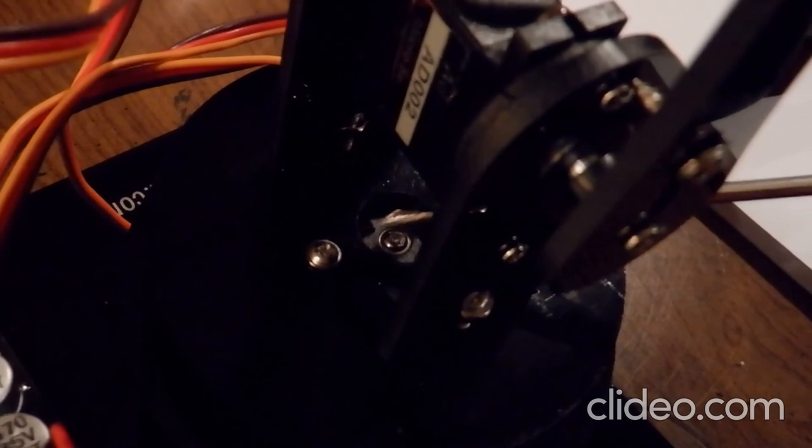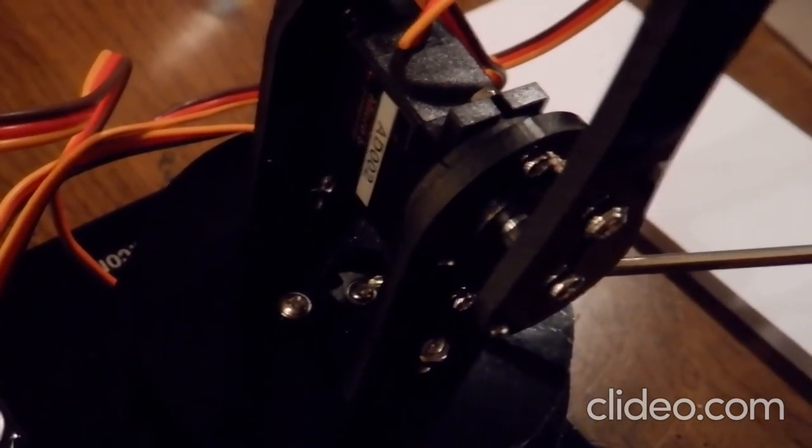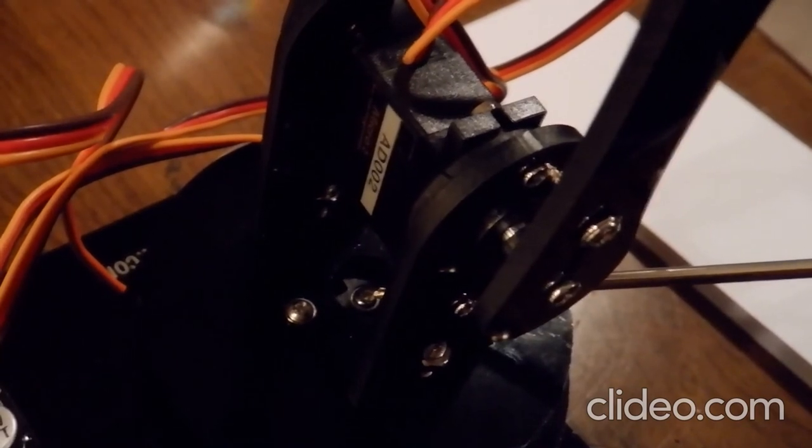And then the final step. So this whole robotic arm piece was loose and wasn't attached to the horizontal servo. This thing at the bottom right here actually controls the movement. So there's one of the self-tapping screws right there at the center of this that I drove. A rocker arm is bolted underneath this disc, and this is the one where these two screws just were supposed to be started, not tight, which is important because this screw right here in this rocker needs to be low enough to reach the servo, which they are. So that was the final step.